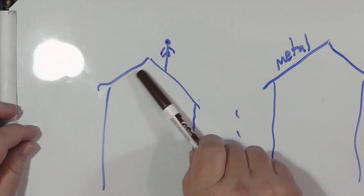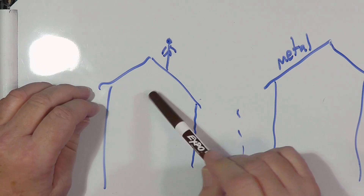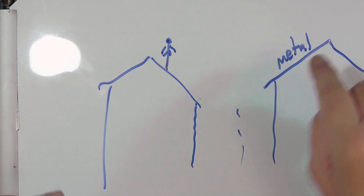Now let's look at the big picture. Assuming that this is a composite roof, you may very well have — even though you have a composite roof — underneath it, the entire roof is covered with something over the rafters that goes between the rafters and the composite roof. It's usually plywood, but not always. Sometimes it's insulation with a foil cover. Sometimes you put up the plywood and then put the foil cover on top of that too. If that's got a foil cover, that'll affect your antenna more than the neighbor's metal roof.